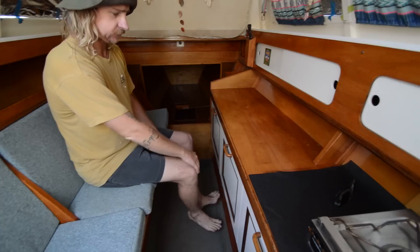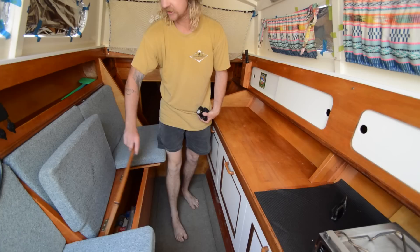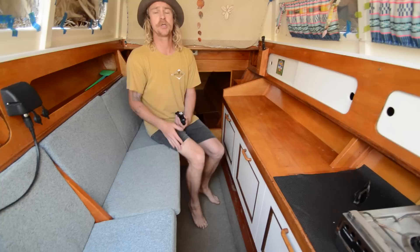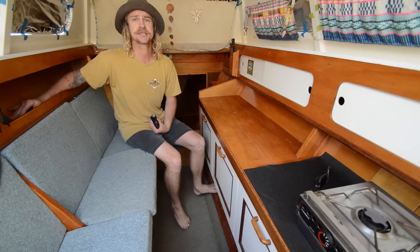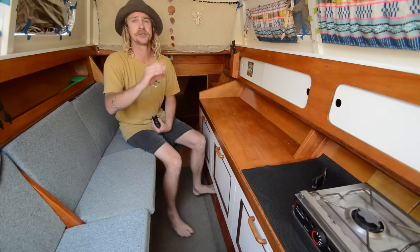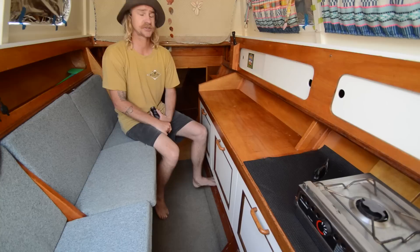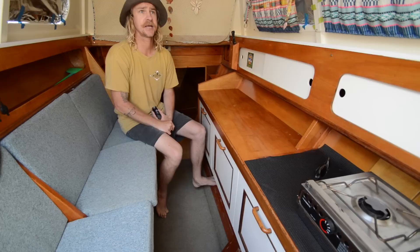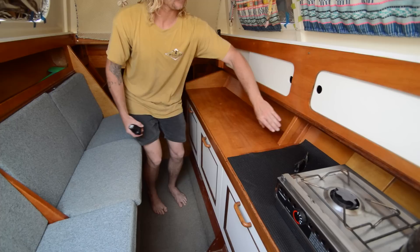All the cupboards are pull-outs, so really straightforward. Plenty of storage under the seats. The hulls are not only fully glass and epoxy — West System epoxy on the outside — but it's all West System epoxy on the inside as well, so she's sound. You won't find any rot in the hulls or the beams. The beams are solid laminated Oregon, and all the bones of the boat are Oregon as well, which was sourced from a warehouse in Port Adelaide. The warehouse was used for storing merino wool, so there's a nice story about the timber — really good timber.